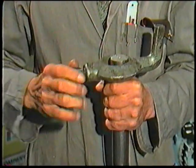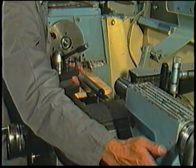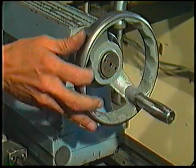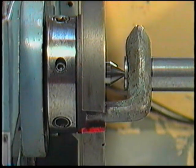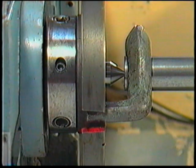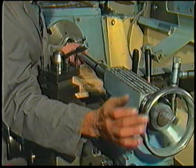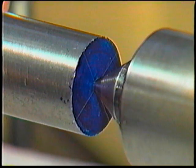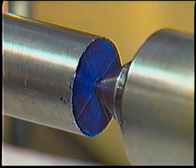Then select a lathe carrier and fasten it on one end of the workpiece. The bent tail of the carrier should be pointing outward. Move the tailstock to a position to suit the length of the workpiece, and clamp the tailstock into position by tightening the tailstock lever or nut. By holding the workpiece in your left hand, place the centre of the work onto the headstock centre so that the tail of the carrier fits into the slot on the drive plate. Advance the tailstock spindle so that its centre meets the other centre of the workpiece, until the dead centre of the tailstock enters the hole in the end of the work and all end play is eliminated. Now turn the spindle hand wheel back so that there is slight end play and the tail of the carrier can move back and forward in its slot.